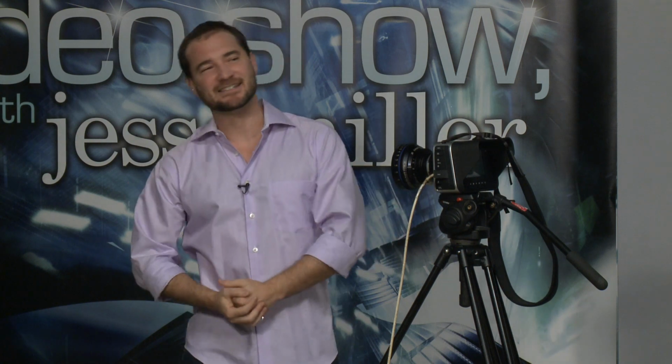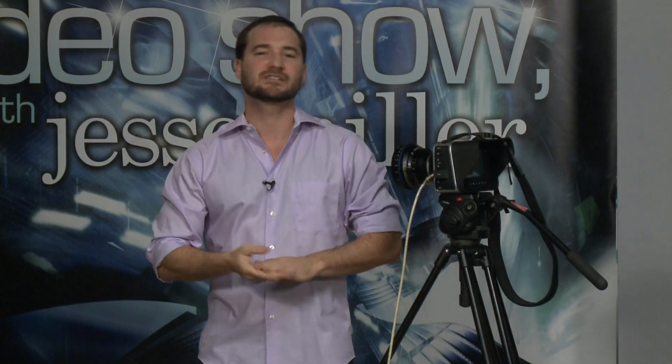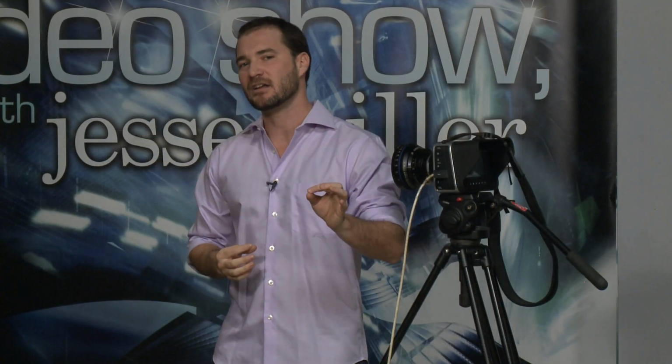All right, let's go back to the slide here to help us get a little bit more information. So we've got a remote input jack, 3.5mm headphone jack alluded to earlier, double 1/4 inch balanced audio input, 10-bit HD SDI output. So another advantage over some of the smaller, the 1/3 inch cameras, the HXR series, some of the Panasonic cameras that are only pushing out 8 bits. If you want to shoot in 10-bit, here you are.